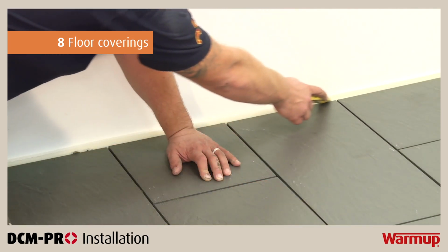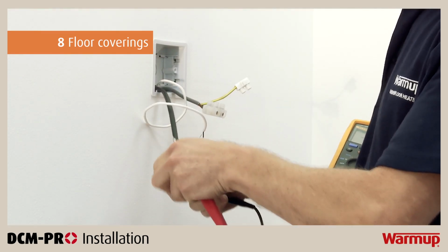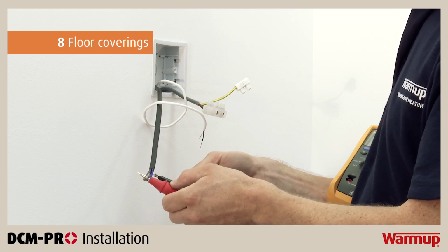Cut the perimeter strip flush with the tiles or leveling compound using a utility knife. Conduct the same sequence of resistance tests as before to make sure the heater and floor sensor was not damaged during tiling.